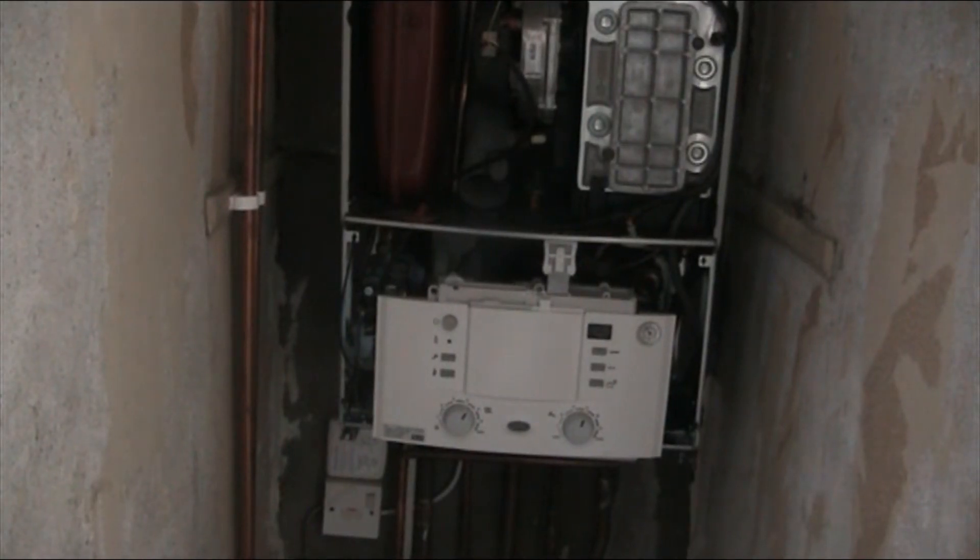The first thing I'll do is switch the boiler off and run the hot water again to see if it makes the same noise. This is to eliminate other types of noise like kettling noise that you might get confused with. We want to eliminate those because kettling has to do with the heat exchanger, but this one hasn't got anything to do with that.